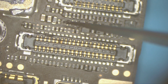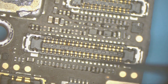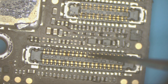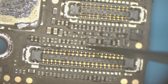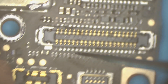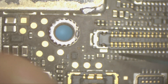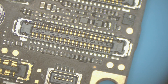What I can see is they applied hot air on the connectors — the connectors are melted a little. Some components are not in place, some components are placed but not 100% correctly, and some components are missing. Here there is a MOSFET related to battery information.